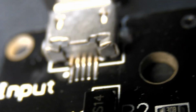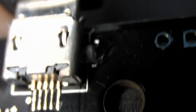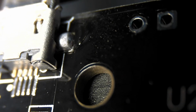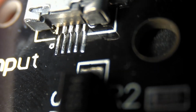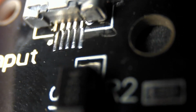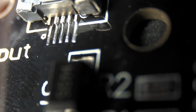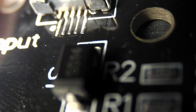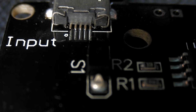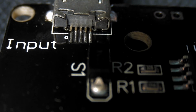The other thing I don't like about this thing is this USB port setup is going to be really weak. It doesn't go through the board. Look how dry those are. See, maybe just hitting that will fix this thing. I don't think that guy's even touching on the end there. Yeah, there you go. There's your problem.